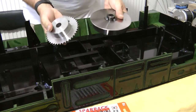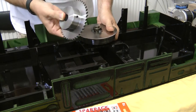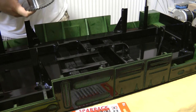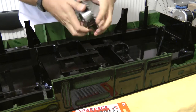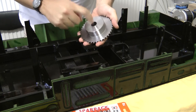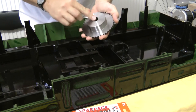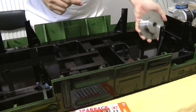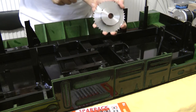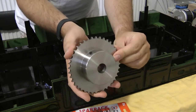I'm not sure if this was available last time — this is the sprocket I got from a local company who sells all sorts of this stuff. It came exactly as seen here. The central hole needed to be bored or drilled up to 20mm, and then another hole here for the set screw. So that is going to keep it in position on the axle.